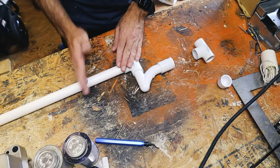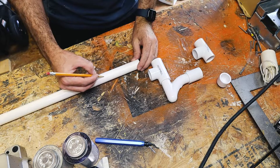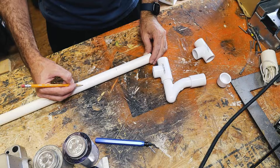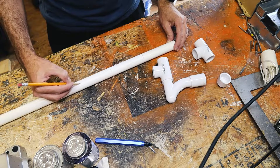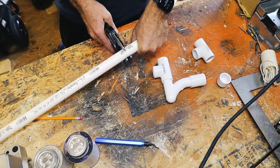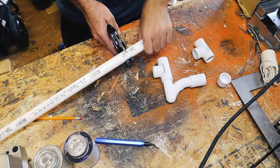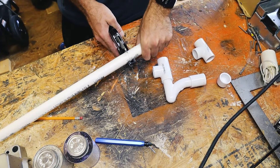So let's go ahead and build this. I'm going to start by cutting some of this pipe up — about four or five inch sections. Doesn't need to be perfect. One of the tricks is to continue to rotate the pipe so you don't crush it. If you just squeeze in one direction you're going to crush the pipe, so you want to keep rotating it as you're squeezing down.